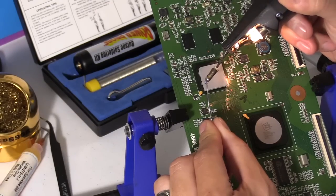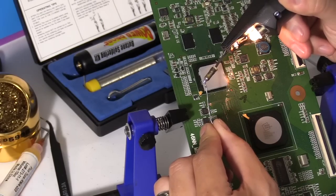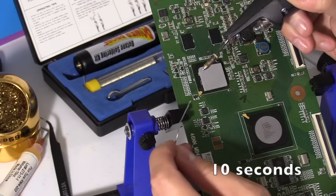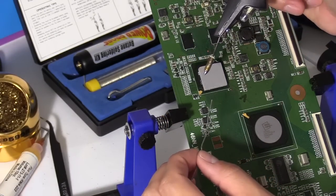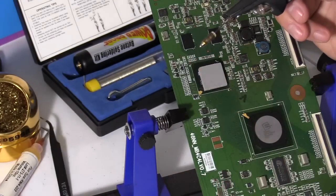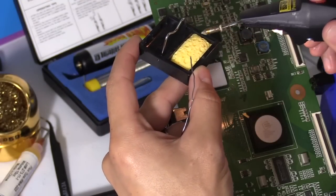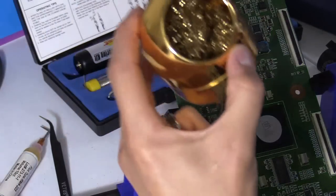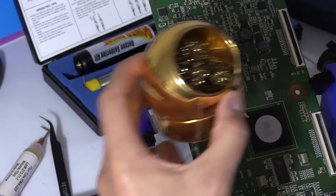I'm going to show you how fast it heats up. All right, there's a timer on the thing. So if you looked at the timer on the video player then you know that only took seconds to heat up. Now that is called tinning. So I just tinned the tip of that soldering iron. It's also good to use a wet sponge to clean the tip. Just wipe it clean just like that. Or you can use something like this and just poke it in there to clean the tip of your soldering iron. That works too as well.